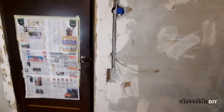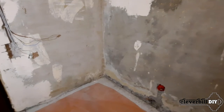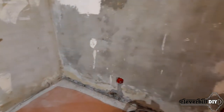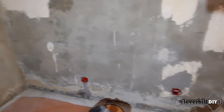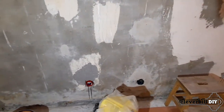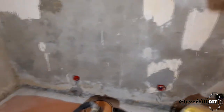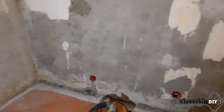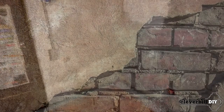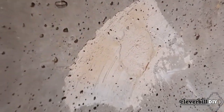The alignment of the walls covers various operations, be it a finishing putty or plaster. Putty refers to the type of coating that cannot be applied in a thick layer. If the walls are not even, there are large defects, or old plaster has fallen out in places, then it is too early to think about putty. Large dips and irregularities are plastered first, since plaster is a coarser filling mass compared to putty and can be applied in a sufficiently thick layer.